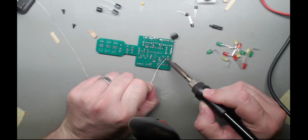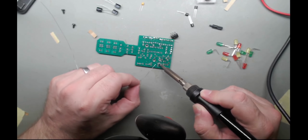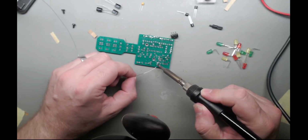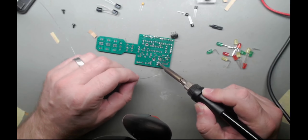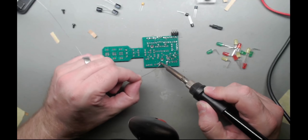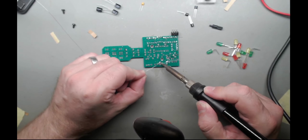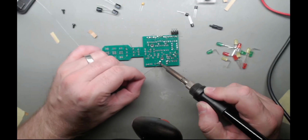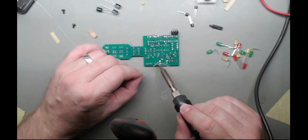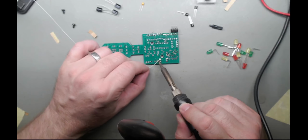I just moved. One of these big holes they take. Lots of room for the solder just to flow down and miss, and it gives a bad joint. No, it seems to be flowing right at the moment. Nice board, no tarnish.